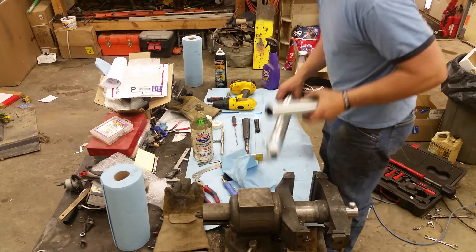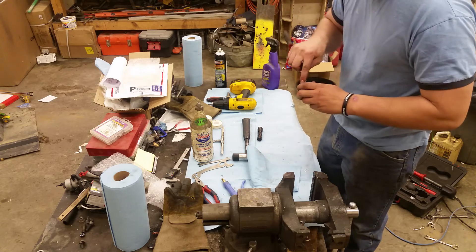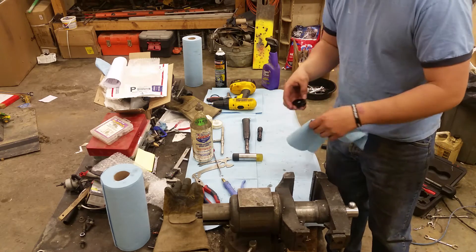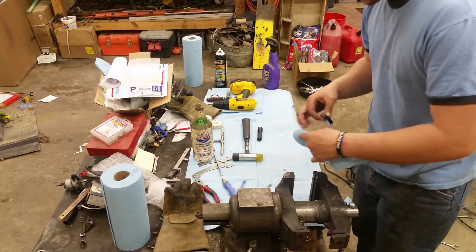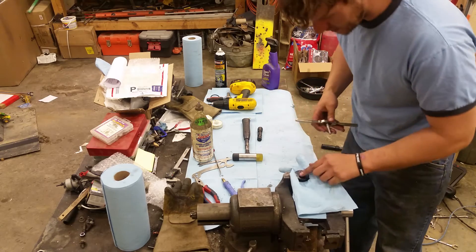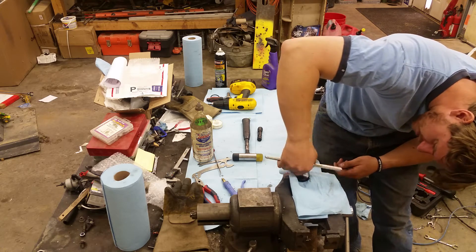Get the shock out of your way so you don't get it scratched up or damaged. Then go ahead and take the cap — I've been pulling the O-ring off each time just to make sure I don't damage it. Grab something to pad this with. Make sure you're running the tap the right way; you'll see where the snap ring sits, so obviously you've got to run the tap in going that direction. I go ahead and clamp it very lightly — if you go too hard you're going to have issues bending the lips and you'll need a new cap. Get that cap started again; the hardest part is making sure you get it in there straight.